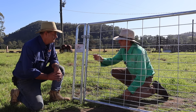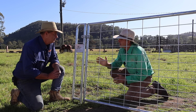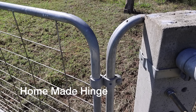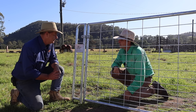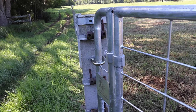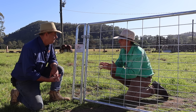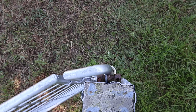There's been a fair bit of thought and research gone into this double hinge panel here. You include these with the gates because gates have a standard size, but in creating this double hinge panel you can create problems - the double hinge can actually bind up and shorten the gate and make it harder to close. With a lot of tinkering in the workshop, we came up with a solution to make it self-align. I designed one hinge to have less resistance than the other, which allowed everything to come back in line. So there are special angles so this one always aligns before the other - your gate closes straight and the correct length.